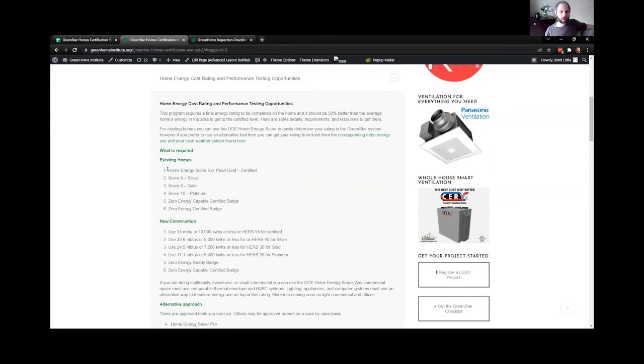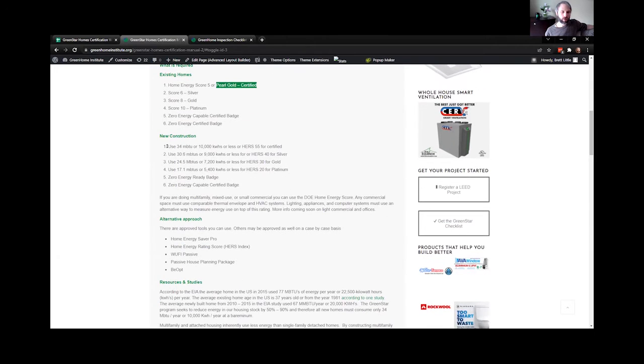All right. So like I mentioned, every home needs to have a Home Energy Score of 5 at the bare minimum. Now, if you're working with a Pearl contractor and they're doing a blower door and you can get it up to Pearl Gold, we'll allow that as another pathway. If you're doing new construction, or an alternative to a Home Energy Score or Pearl rating, for example, we have people doing ASHRAE 90.1 assessments on some of our multifamily buildings, that's fine. If that's the case, I should probably update this to say new construction or alternative rating tool.